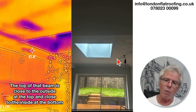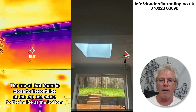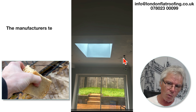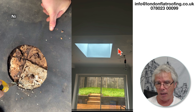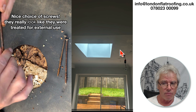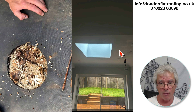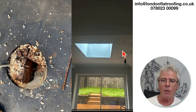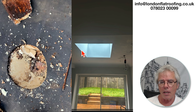There are more problems here, because even if it is a proper warm roof, the amount of water which has come through — there should be a vapour barrier underneath your warm roof. That vapour barrier doesn't let water or vapour through, but with the amount of water I'm seeing here, you've now got insulation sitting in a puddle of water with no real way of getting out. It can't dry, there's very little movement of air up there, and wet insulation doesn't perform well. So you've now lost all the performance of having an insulated warm roof because all the insulation — if you don't change it — is going to be wet.